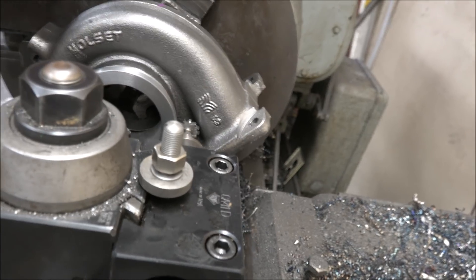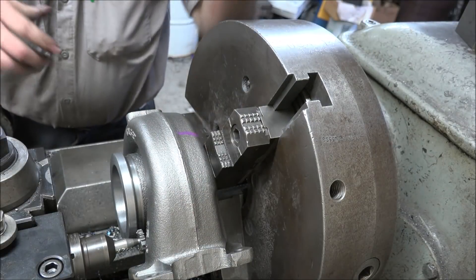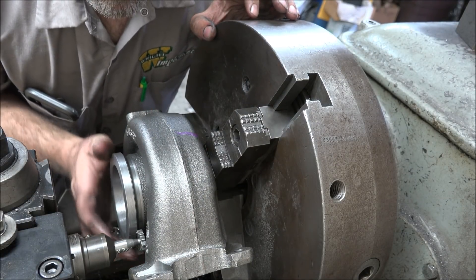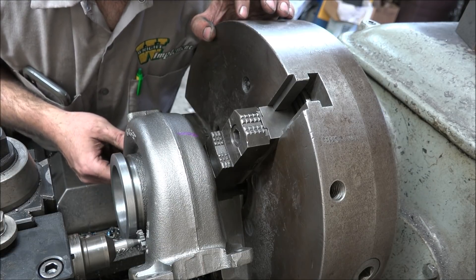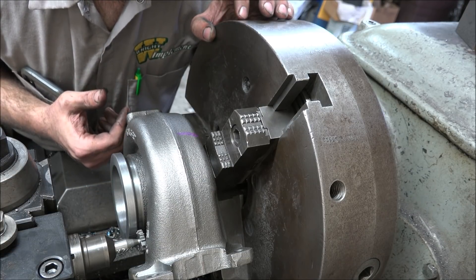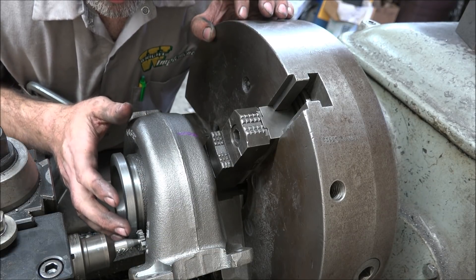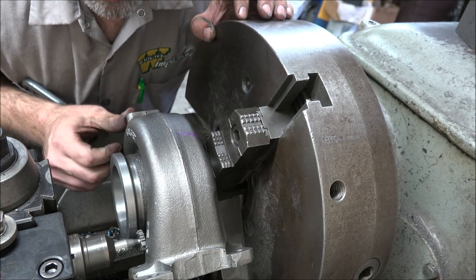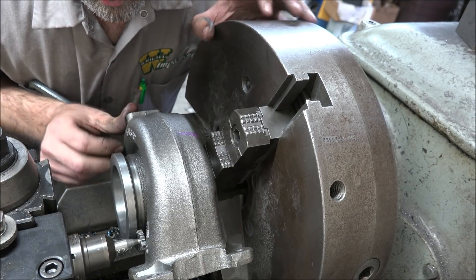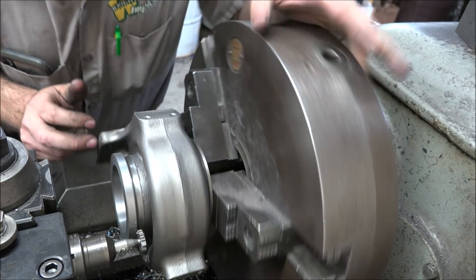Now, you probably can't see what's going on here. Maybe you can see what I got going here. I've cheated — turned my wires around on the lathe so it should run backwards now. And that should get this rotating in the right direction. I'll be able to use this woodruff cutter to come in here and cut the back side of this, because I don't have clearance with any of my other tools to reach and clear this flange.